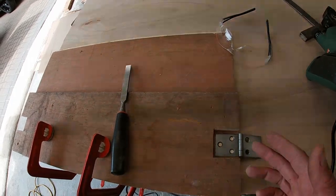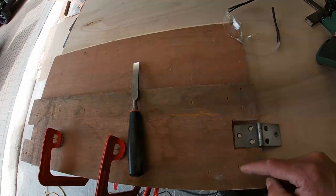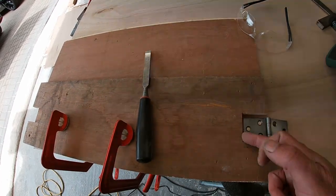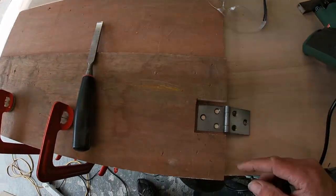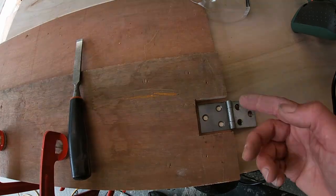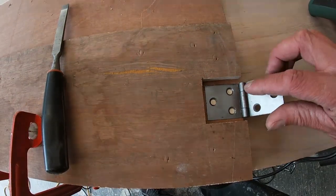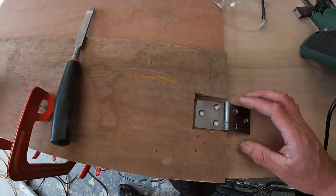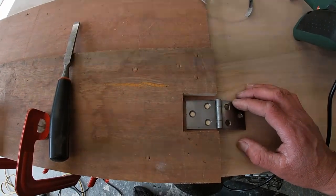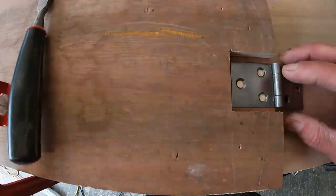When you're making the template, the difference of 9mm means it's four and a half millimetres each side. You've only got three sides because this end is flush with the end of the timber so you don't need the four and a half mil there. But yeah, that's come out really quite well. So I think what we'll do now is mark our position for the hinges and get them mounted — we've done the hard bit to be honest, quite pleased with that.